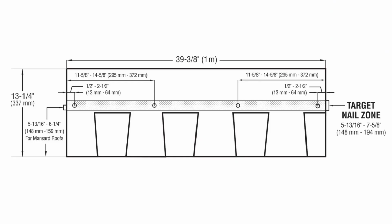So I'm located here in Minnesota, and most of the roofs that we inspect have asphalt shingles. And the nailing instructions, the fastening requirements from just about all manufacturers are pretty much the same. There's very little difference from manufacturer to manufacturer. The requirements are that you have a nailing strip in every shingle. It's a place where nails are supposed to be located. You're supposed to use a certain type of nail. It's supposed to be driven in at a certain depth, and it needs to be located in a certain place on the shingle. It's all pretty well laid out.